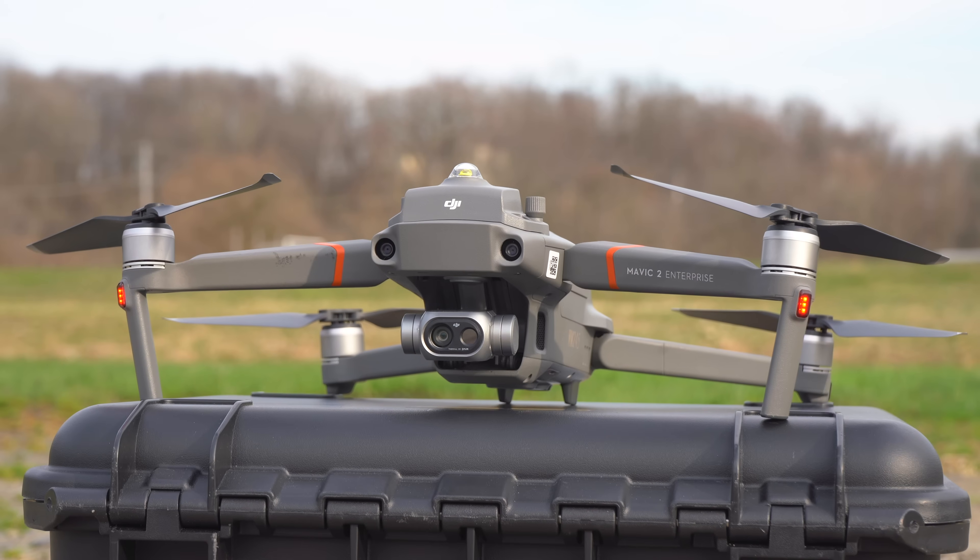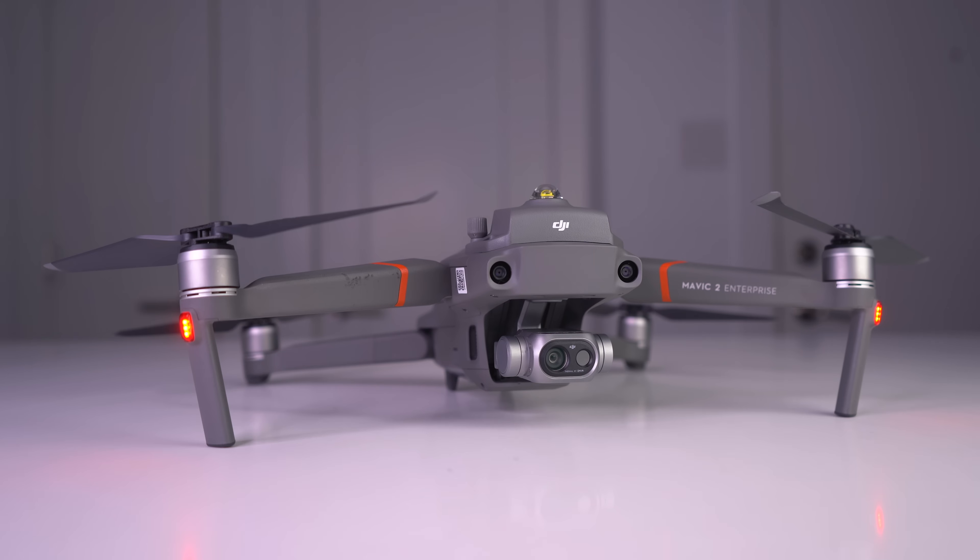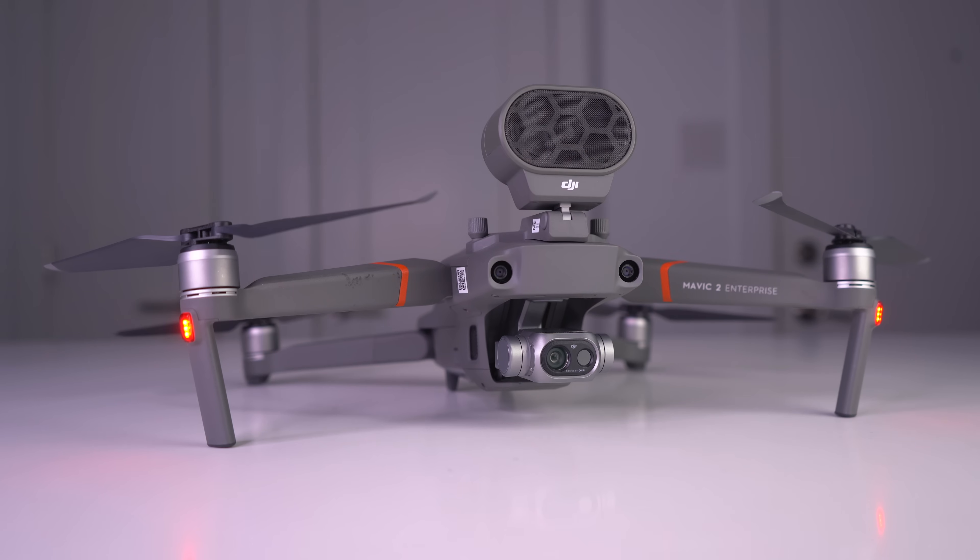This is where the thermal camera that makes the Mavic 2 Enterprise Dual so special comes in handy. The body temperature is usually distinct compared to the heat of surrounding objects, and setting your isotherm settings properly will let you easily pick out a person even from heights of about 120 or 150 feet above the trees. Even when looking through a heavily wooded area, you can pick me out in the middle of the trees standing alongside my dad. Aside from the thermal camera, the attachments and accessories that go on top are probably equally as helpful. The light beacon ensures safe nighttime flight, the spotlight lets you flood light into certain areas, and the speaker lets you communicate with injured targets who can't move. These are like the only drones that have these accessories, and they prove to be really helpful.